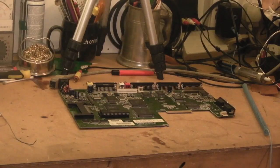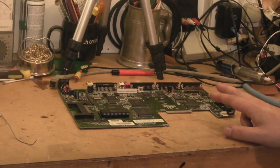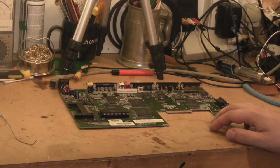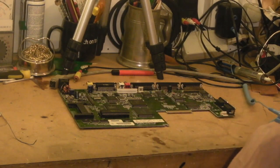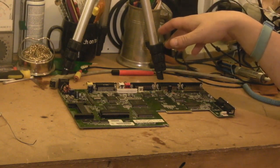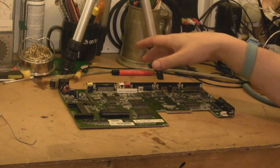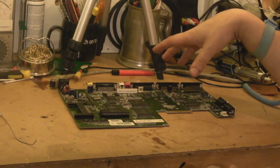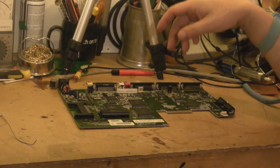Hello there, it's Jay here from Jay's Vintage Junk, and today we're going to have a look at doing the disk change mod — basically the disk swap mod. A lot of people call it an ABBA mod. What it does is it allows you to swap between having the internal or the external drive as DF0, the main boot drive. A lot of Amiga software won't boot off an external drive; it wants to boot off the internal floppy drive.